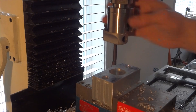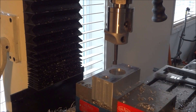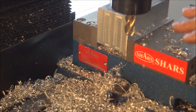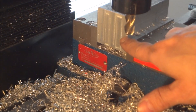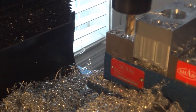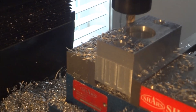Now I'm going to change this out and go down and put my step with a half-inch end mill. I'm set up, and I'm just going to go around just like I did for the X-axis and put that step all the way around — it's three-quarter inches deep.